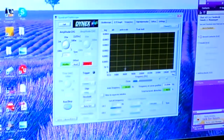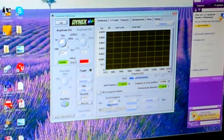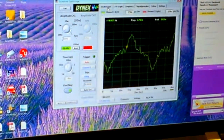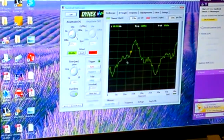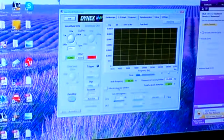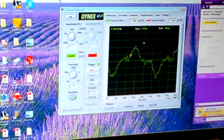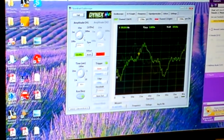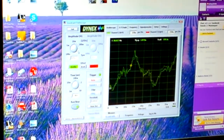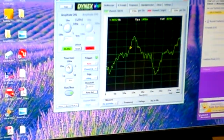What I did was turn the pass down so that these frequencies that are making it really dirty aren't getting through anymore. You have to play with how much you're going to clip it - if you turn it down too much you're going to get nothing, it'll completely clip the signal. Remember what it was at around 1600 - that's as clean as I could get it, and you'll see it doesn't have all that junk in it anymore.